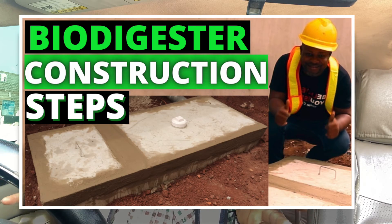Remember, that's how we construct the biodigester, but there are cases where it will not work. If it won't work, you need a traditional soakaway, or you need to have it pumped out, or connected to the drainage system for longer use. However, in situations where the digester is only for one toilet or one or two people, and the land is good, instead of the additional cost of a traditional soakaway, you can do the so-called pit.